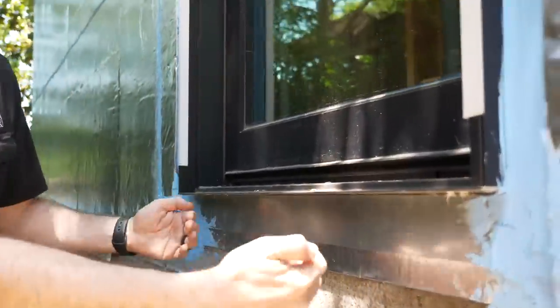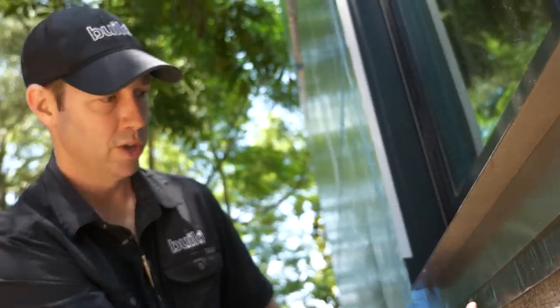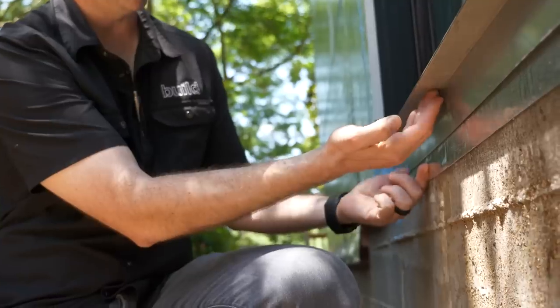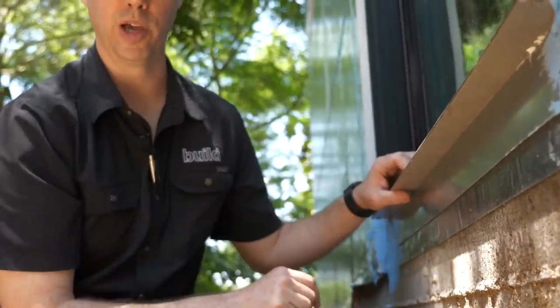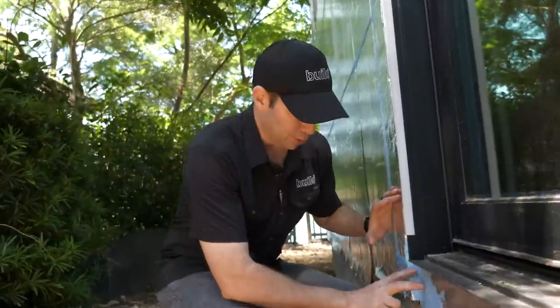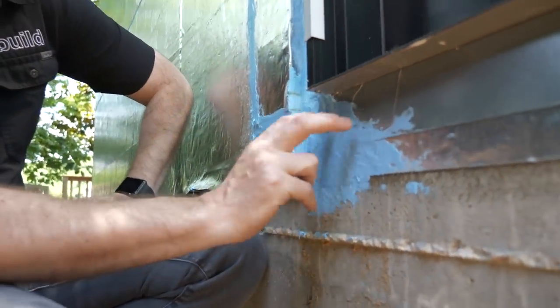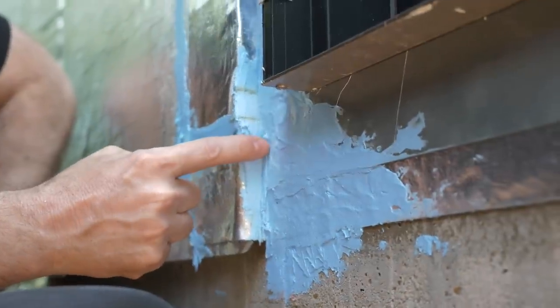You can see that pan has a bottom leg right here which is running over the foundation, or this might be running over the wood frame. You'll also know that we've shingled that correctly — below here is the water barrier that we've run up, and then we put the pan on. You always want to start low and work your way up — that's the first rule of shingling. The next thing you'll notice is this Blue Barrier fluid flashing covering over all those joints.